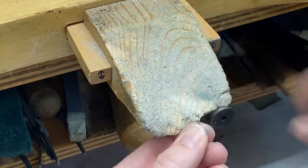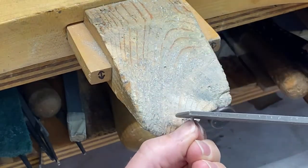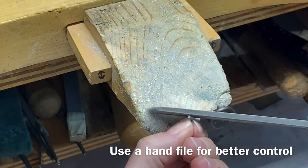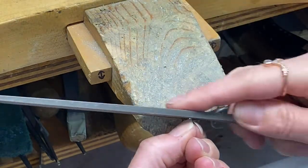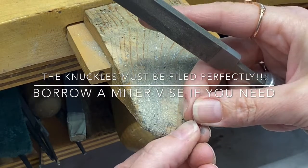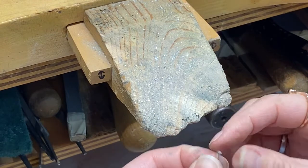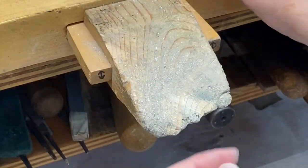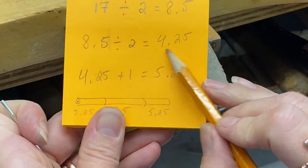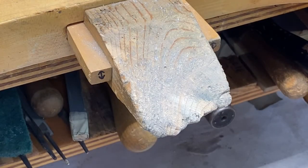File this to your line exactly and perfectly. Use a miter vise if you want, or get used to filing tubing by rotating until it's perfect on your set square. Notice that I am using a flat hand file, not a needle file — this is to make sure it's perfectly straight, and it's much easier to control. Double check on your set square to make sure it's perfect. Then you can test it out on the bottom piece of your locket. It is now time to cut the two outer knuckles — the ones where we added a millimeter. For me that is 5.25, and you need two of those shorter knuckles.